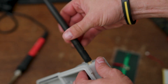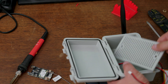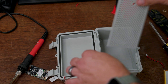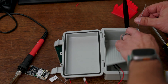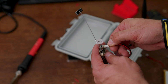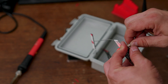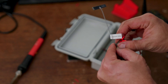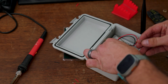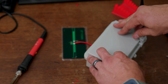Screw on the antenna — since the box sits flat, turn the antenna upright. Remove the base plate, drill another hole for the solar panel wires, and fill the holes with epoxy or hot glue to make them watertight. The little rack inside will keep any water below the electronics. Connect the solar panel and battery to the block — you'll see the lights come on. Make sure all connectors are tight, then hot glue the solar panel to the top of the case so it doesn't move.